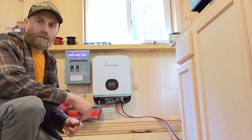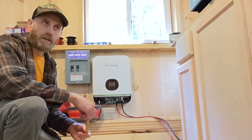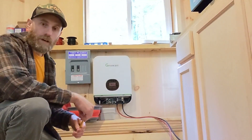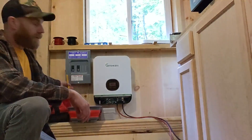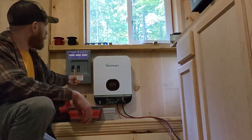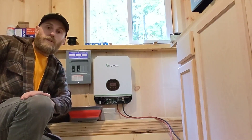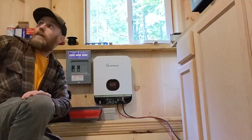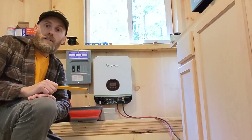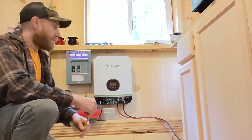I did this all off camera, but I just wanted to give you a quick overview on the solar system I got installed here at the cabin. It's not hooked up to panels yet — I'll hopefully record that part. As you can see, I got a 100 amp panel with two lines with fuse breakers: one going around this direction to feed a couple receptacles and the light switches, which will control the can lights in the ceiling and the ceiling fan, and one going the other way to feed a couple more receptacles on that side of the cabin.